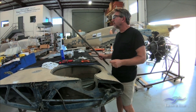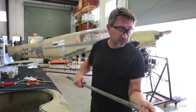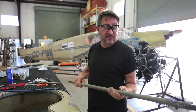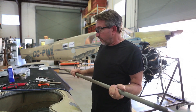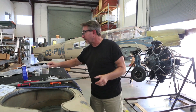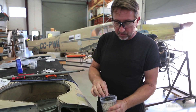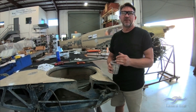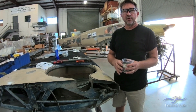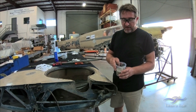Now we need to strip the paint off the part we took out — it has all the original Messerschmitt gray paint from inside the wing. It's an aluminum piece. There are different stripping options. People talk about sandblasting — this is sand, a special grade that comes in different grits. We don't really use this on aluminum; sand is normally used on steel. During a restoration, we only use sand on a steel tube structure like an engine mount or steel tube fuselage — a Stearman, a Stinson L1, or a Piper L4. We wouldn't use it on aluminum.